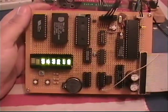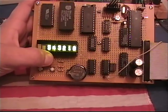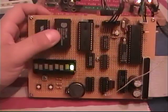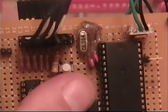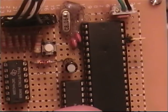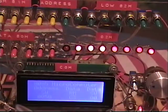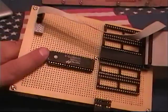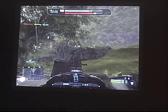I'll go ahead and show you phase two — I've already started on another one. This one's going to be better. It's harder to see right now because I don't have the covering, but it's counting 0, 1, 2, 3, 4, 5, 6, 7 — I just did that for a test program. I've got a non-volatile 32K RAM, here's my ROM, and my processor. This one's actually running a little faster — 8.064 MHz divided in half gives you 4.032 MHz. The main thing I did differently is I have all the ports where I can get to them, and I have more board on the back, so it's going to be a lot better. We'll make another video when this one's done. I hope you like my video and I appreciate your time. I'll see you next time.